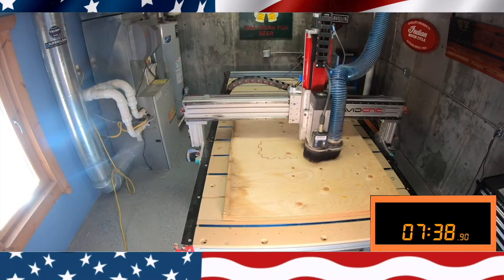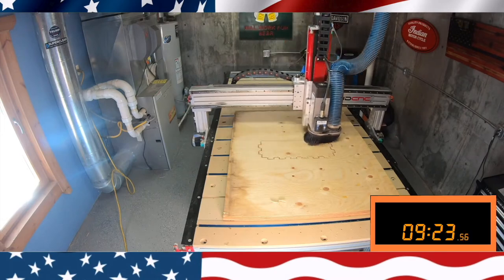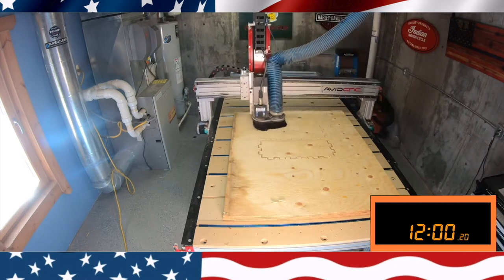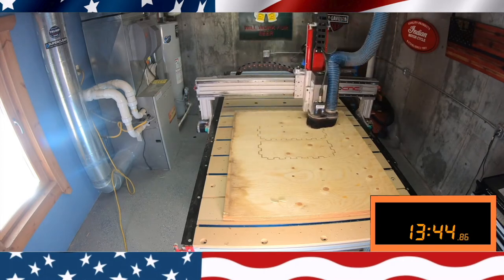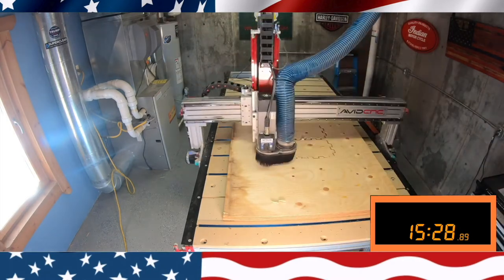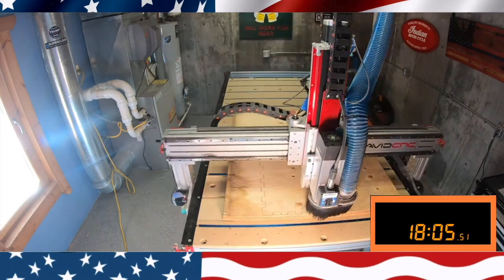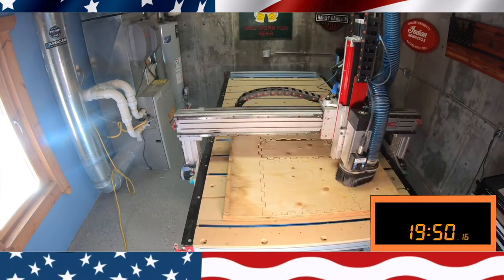I decided to move. I went back in the drawing, and I moved the templates around on the material. And then instead of using the Gadget toolpath, I created a new profile toolpath. And you cannot do that. It's not going to follow the same way as the Gadget toolpath. Now what it did was it cut all the sizes out perfectly, but the female and male square tabs were wrong. And you'll see that when I take it over to the bench.